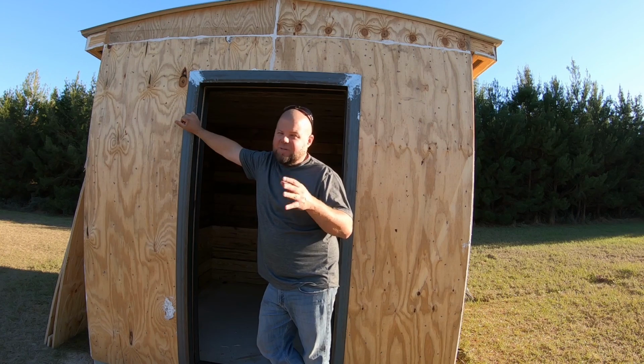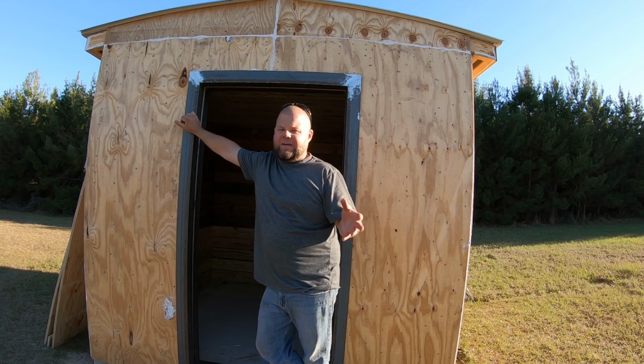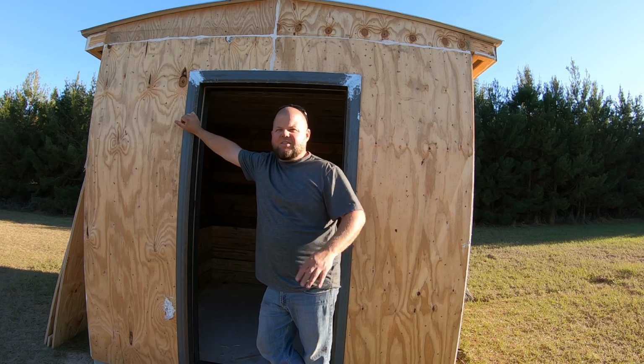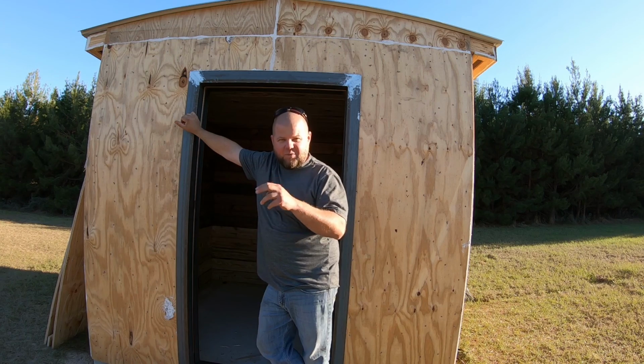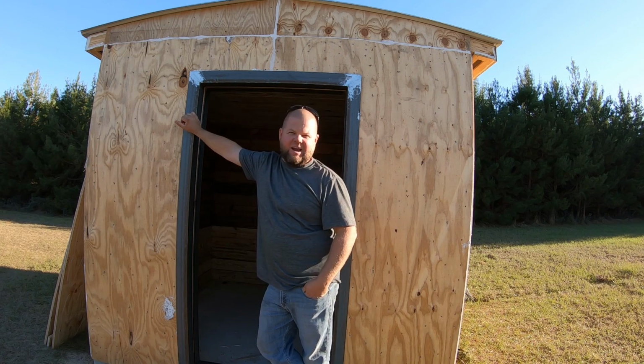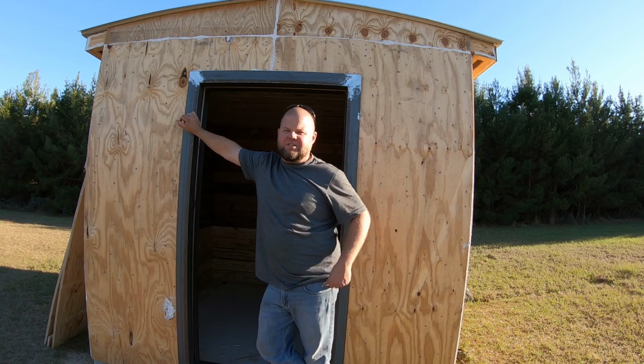It did awesome. I've still got to do some fine tuning and dialing in, but it's day number 1 for me. I mean, I didn't expect to nail it right on the head. So I'll fine tune and play with it. By the time I got close to the end of welding all this, I was playing with it a little more and starting to get that kind of bacon frying sound. So I'm getting close to getting it dialed into the right settings, at least for this 3/16 steel.